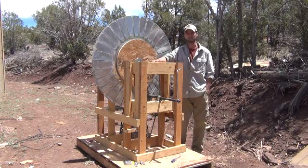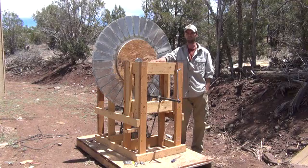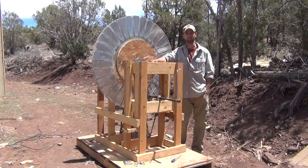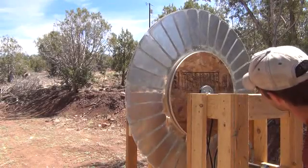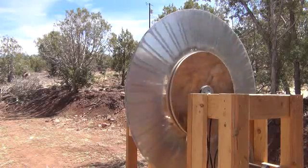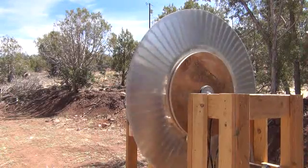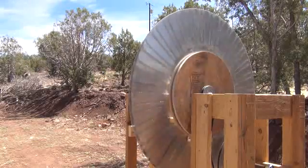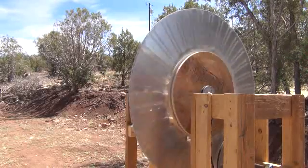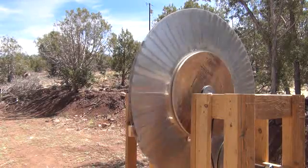That way you're not going to get nailed by anything from this machine, because this machine is going to produce very, very high voltage. I'm going to spin this for you for a moment, then go through and explain it in more detail. So there you go — there's our large four foot in diameter Wimshurst generator. The discs are now rotating in opposite directions, and we're ready to go to start building our combs and brushes, which are the next part of this project. Seems to flow pretty well — I don't hear any grinding sounds, and I'm not having to turn this very fast.